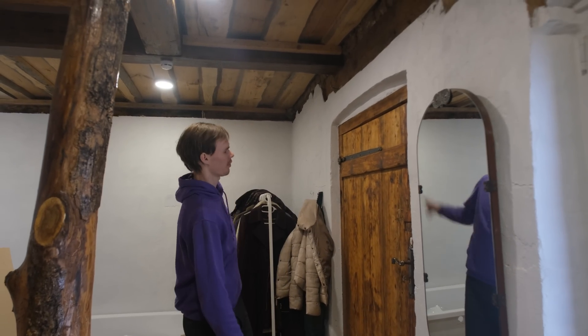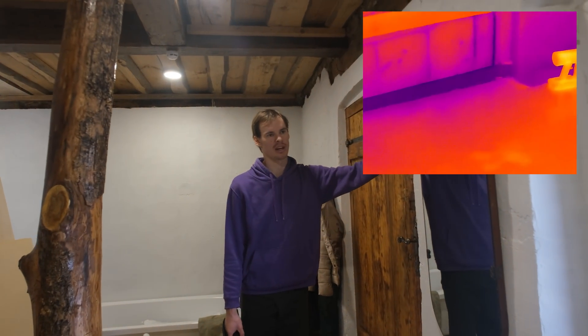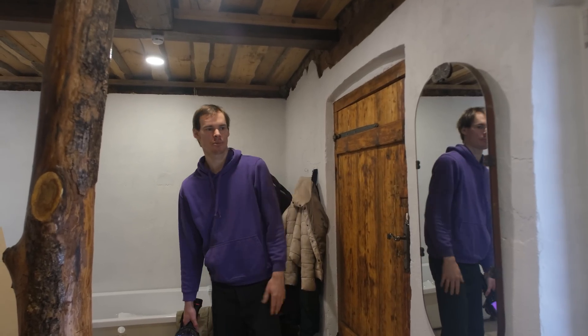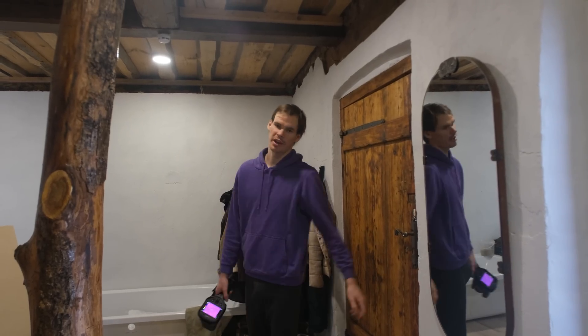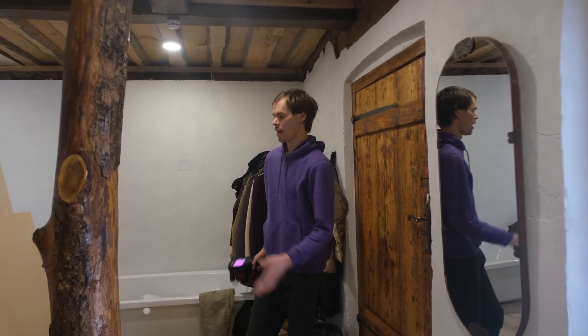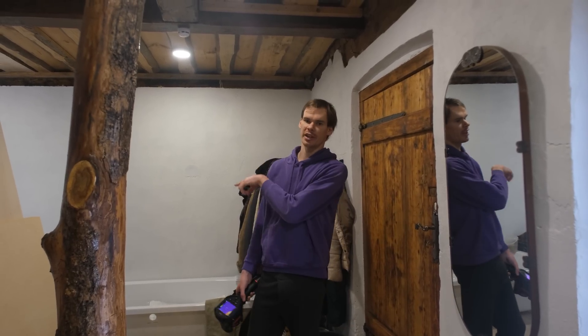This tower is actually pretty good — especially the floors are working incredibly. As you saw we also inspected the hallway and that one is a lot worse, since the walls are just brick without hollow inside so there's nothing stopping the cold from passing through, and it only has one tiny single radiator which isn't even close to heating a third or a fourth of that room. It would need a much bigger radiator to keep the place warm. But let's get dressed and go outside.